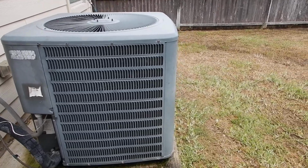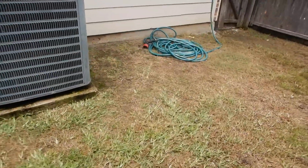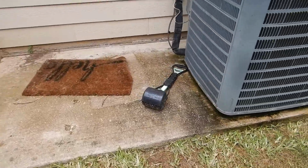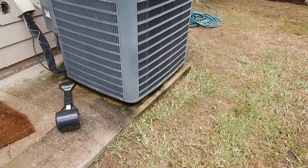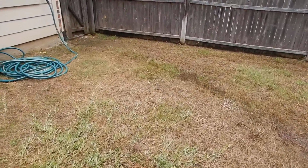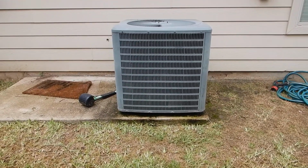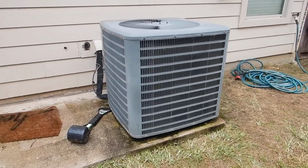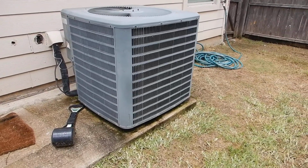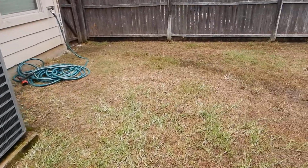This is like an air conditioner with a reverse, and air conditioning guys hate when I say that, but it's true. What an air conditioning system does is it takes heat from an undesirable location and moves it to a more desirable location. You put your hand behind your refrigerator, for example, it's warm back there because your refrigerator is extracting the heat from inside of the box, and it's got to put it someplace more desirable than having your cheese get moldy and your milk curdle and your beer get hot, name your pleasure. If you unplug the refrigerator, heat goes to less heat.